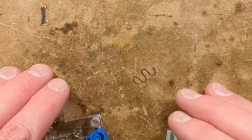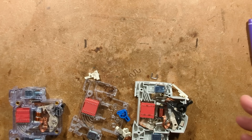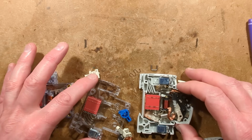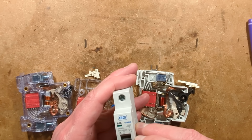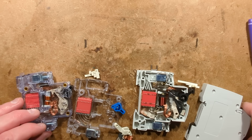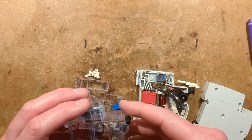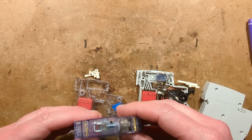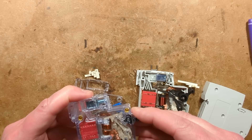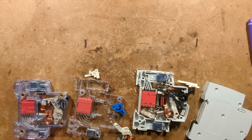It's amazingly complicated given that this thing costs very, very little — you're talking about three or four pounds for one of these circuit breakers even from a prominent UK seller. And look at the complexity inside. These things are rated — well, this one is rated to break a fault current of 6,000 amps; that's what it's designed to interrupt in the case of a short circuit. Very interesting, much more complicated than you might think, and mostly foolproof in the sense that you can't force them to stay on — they will trip internally. There is another thing that can go wrong: contacts burning up inside, and when hot — particularly with a bad connection — will cause random false tripping. These are standard miniature circuit breakers, and they're well worth taking apart.